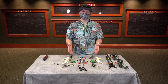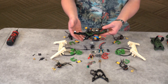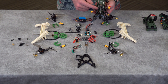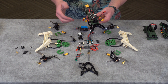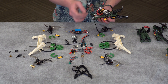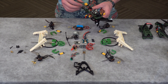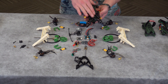We're going to talk about the components that make up the main drone and how the drone is assembled. You'll see here that we have the main electronics deck — this is where all of our important components are mounted. We have our flight controller, our speed controller, and our motor drive controller on the bottom. We have our compliant gripper controller, and everything is on quick connectors. For our video link, we have an HD video transmitter, and a flight control antenna — that's how we control the drone. We have a 5-volt and 12-volt regulator, and our compliant mechanism — all mounted on the electronics deck.